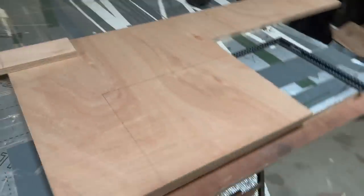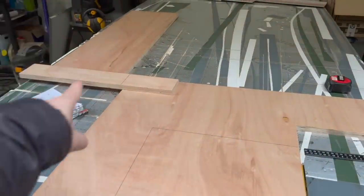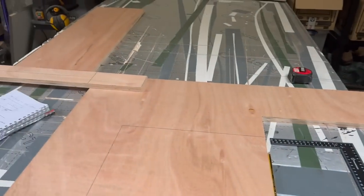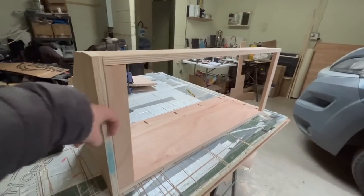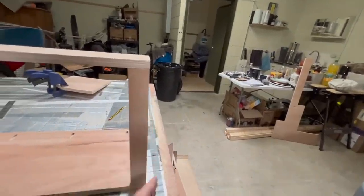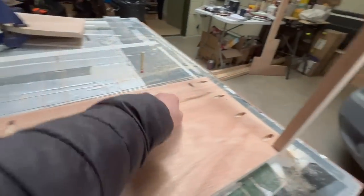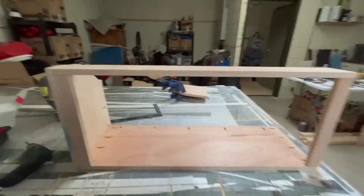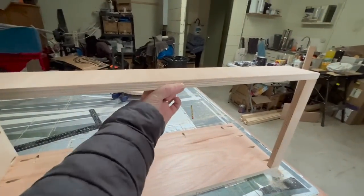I've literally just copied what John's doing - just having the bottom, side, top, and some supports. I can draw out one more thing and get cutting my first top cupboard. So scribing, obviously, is perfect for the end. I returned it just so I don't have to have the door right up to the end, and this is going to butt up to the tower I've just put into the kitchen. I'm going to start screwing into it all the pocket holes because that isn't moving, and then this is going to get screwed up into the metal bars - there's one about here and one about here - and I'll pop a couple of smaller screws up into the ply in the ceiling as well.